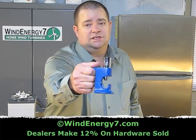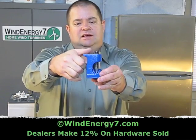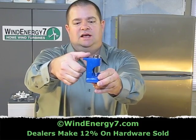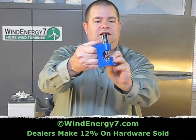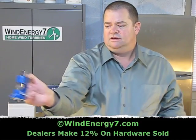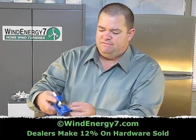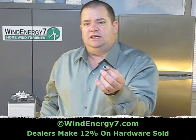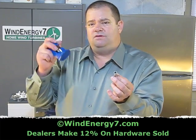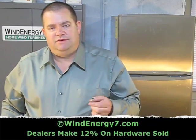This is another good tool I like to have — this is a battery cable crimper. This little guy has sort of a bullet plunger in there, a little thumb trigger to open it, and it's spring-loaded. You put your cable in your lug, put that right in there, and let it close down on it. Then, on a steel or concrete surface, you hit it with a really big hammer, and it crimps it in a V-shape because of the plunger. It gives you a little more contact than if you just crimped it flat with a vise. That's why I prefer this — it gives you a U-shape or V in there and gets you more contact with your cabling than a vise would. Either way is fine.